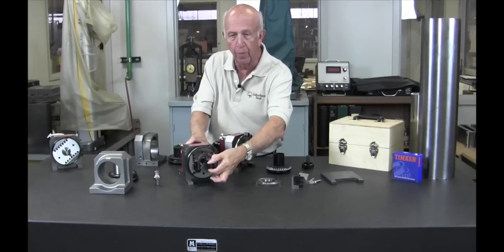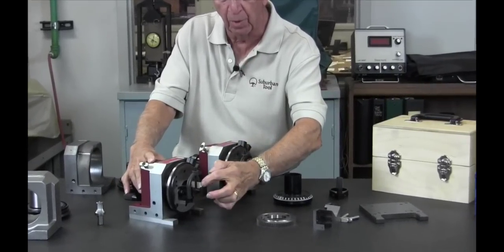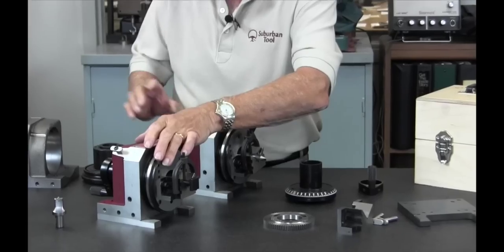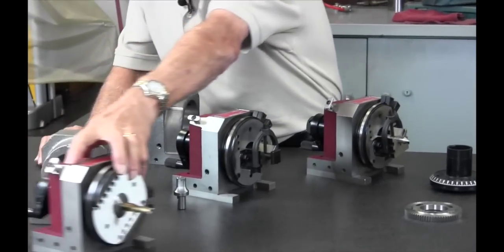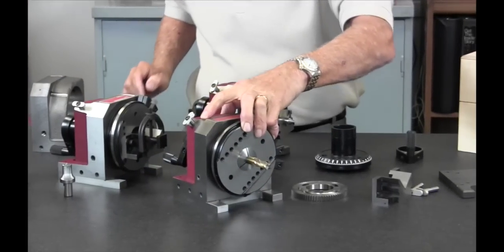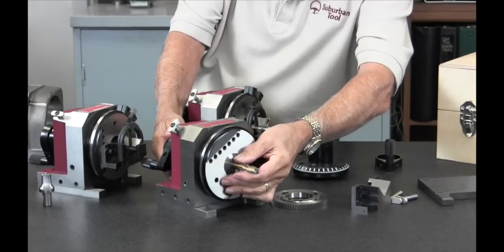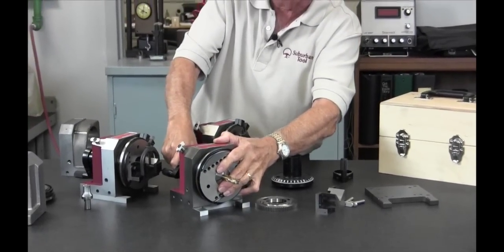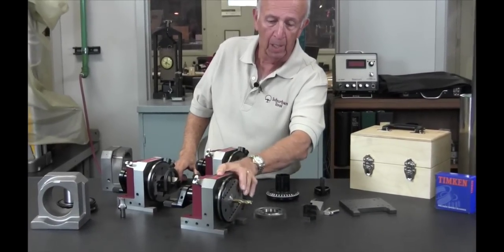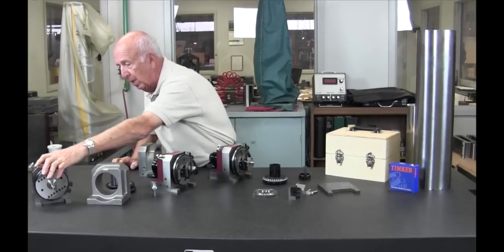Here's an example of grinding four sides 180 degrees apart, so 90 degrees on each side. And lastly, here's a Master Grind with a V-block on it and a 5C collet in it — so with a 5C collet you have access to most any dimension, any radius you want, for holding anything that's round. It's really a versatile tool.